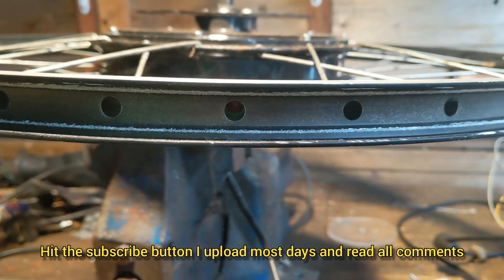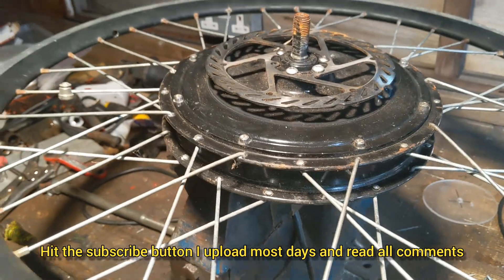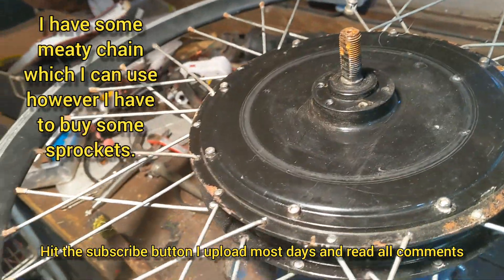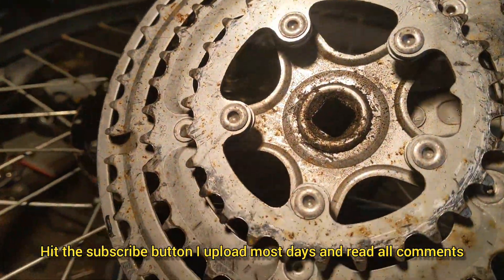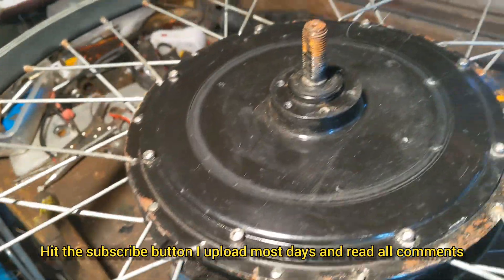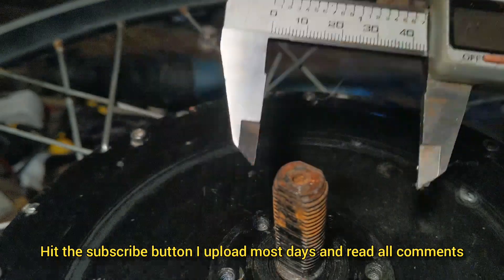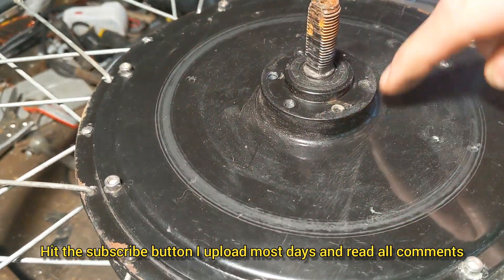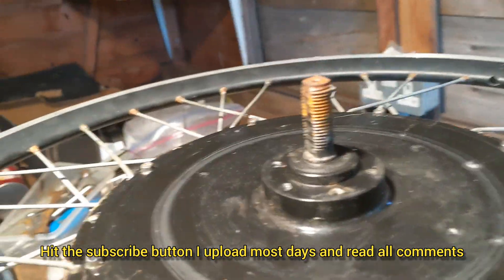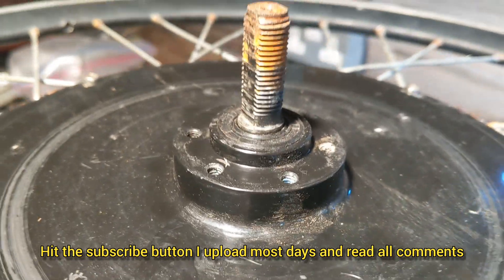What I'm going to have to do — because I'm serious about going ahead with the project — is to butcher the wheel. I was looking in here and there's just lots of rusty bolts, so I'm going to have to get the grinder out and chop the spokes off. That's what it looks like without the brake disc on, with a couple of bike gears. Looking at the back, the mounting holes are 44 to 45 millimetres apart, so some kind of cog needs to connect to this and turn it. This is going to be fixed — you can't have it any other way because of the wires, unless you could knock up some slip ring arrangement. So I've got to suss out how to connect a gear of some kind to that.